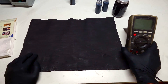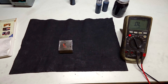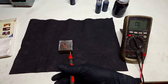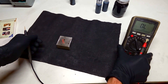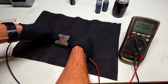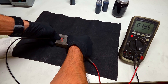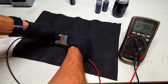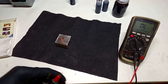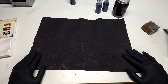For the chemical resistance it will depend on what base material and what binder you will use. So first I will check the conductivity — I will measure the square resistance of this conductive cloth. And at the moment I get 19.5 ohms, which is actually not bad for some homemade conductive cloth.